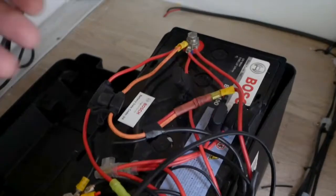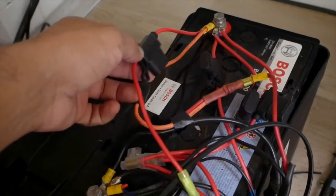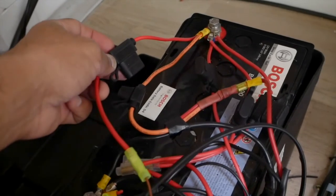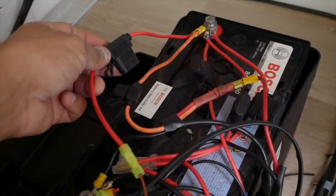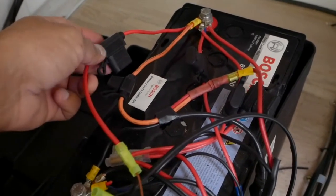How did I do the wiring? I began with an inline fuse — keep the inline fuse empty as you do your wiring, and after you've completed your wiring put the fuse in. That's going to make things very safe so you're not going to have an accidental short circuit while you have bare terminals lying loose.